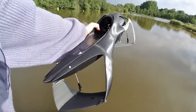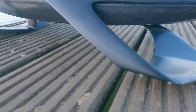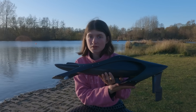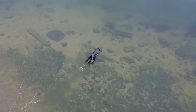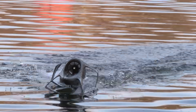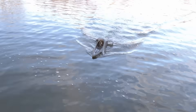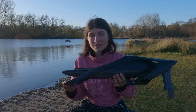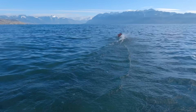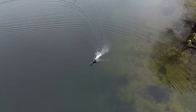Hydrofoils also have to control the height above the water, but hydroplaning boats like this one don't. The Hydrojet's wings are fixed — they bolt on and the angles don't change. Once it transitions into planing, it simply stays effectively flying on top of the water until it loses enough speed and gently glides back down. Its lift comes from the bottom surface of the wings, unlike hydrofoils — hence why it's hydroplaning. This happens completely passively with no need for any wing actuation.